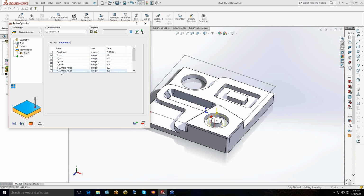It's in the 580 range, I believe, in the machine controller. We have added the ability to take that information and store it into parameter locations. So you can use it semi-pseudo to a CMM machine, to interrogate things based on what the probe finds and save them for use later.